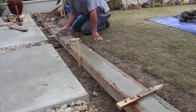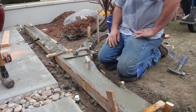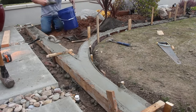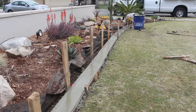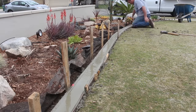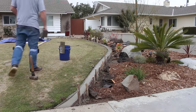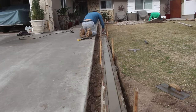Here's the form adjustment I mentioned - we cut into that radius and went straight across right there. I noticed it was kind of bowed out, so I just grabbed a stake - it could be a rock, a stake, or a chunk of wood - and wedged it in there to make it straight. You've got to do that before it gets too dry.